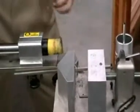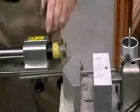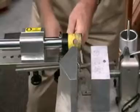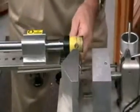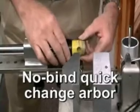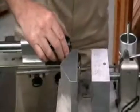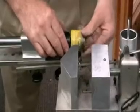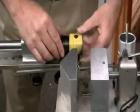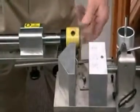First we'll change out — let's do a two inch. For this non-jamming hole saw, we can change them out typically just by loosening that, pull it back, unscrew it by hand. You can't do that with other arbors. This is a two inch. Screw it on all the way until the bottom's out, and we'll back it off until the two pins engage. Screw it on — we're ready to go on that.